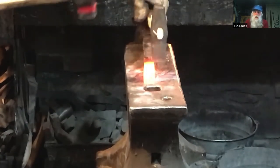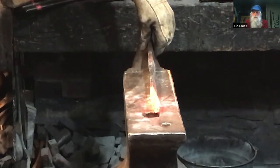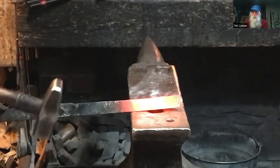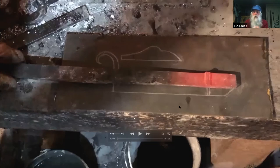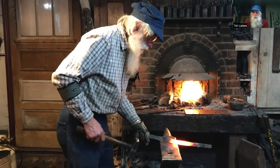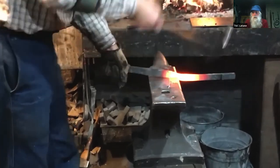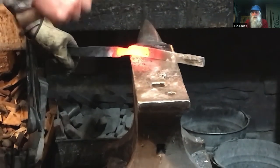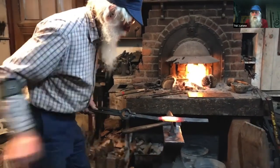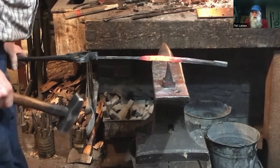Using a set hammer with a nice corner, pressing either side of the lug gives a blow that couldn't be done with a regular hammer. A little filing was done afterwards. The lug is now visible on the front, and the location for the shoulder to start the scroll on the back end is marked. Most of this section has been drawn down to about a quarter inch but left a little thicker back where the scroll will be. A soapstone mark shows where to make a shoulder, then a far-edge shoulder thins what's over the anvil but leaves the rest wider.